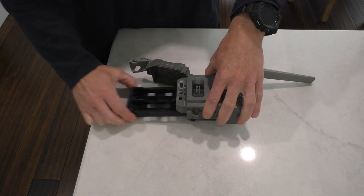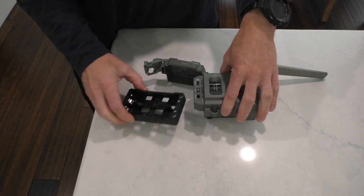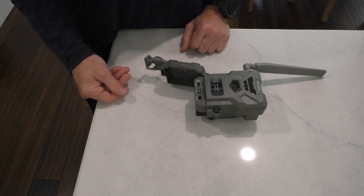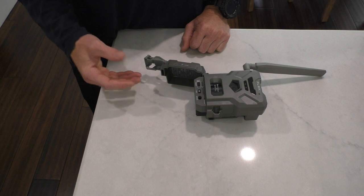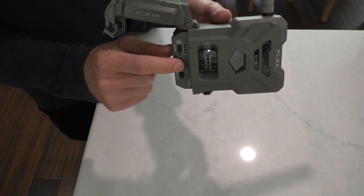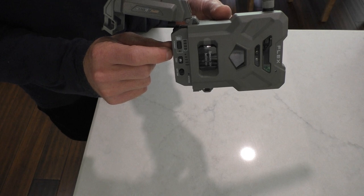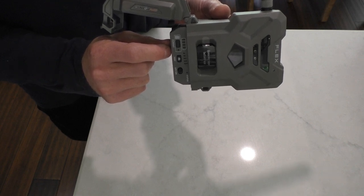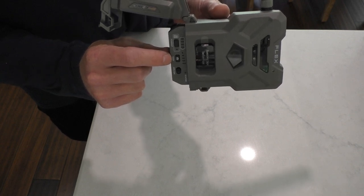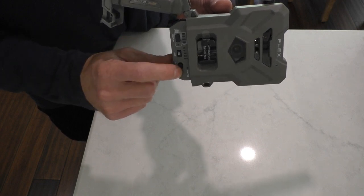It's got a new battery compartment — it still takes eight double-A's and you're going to want to use lithium. The nice thing is it's got a really nice feel when it clicks back into place, so you'll know it's nicely seated, and hopefully these ones won't have the problem of not making good contact. The next things you'll notice are your battery level, your signal level, and a format button. While that light's on the format is ongoing — don't touch anything. You also have a test button, so always make sure you test it and get your picture back before you leave.